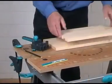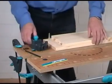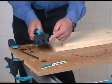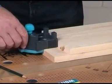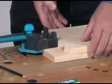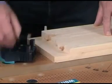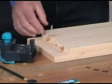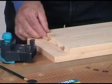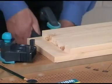Finally, you place the top of the shelf flat on the side of the shelf. Afterwards, you place the Dowel Master on the side of the shelf and move the top until it lies against the stop of the Dowel Master. Please mark this place with a pencil and draw the top a little bit back. Then please clamp both boards with clamps on the workbench.